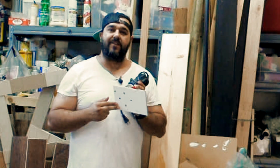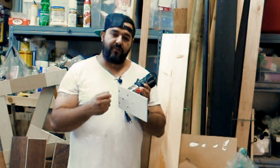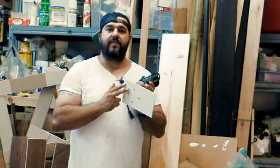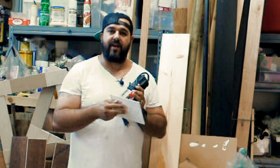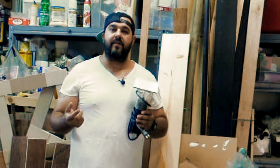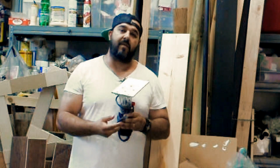four 1/8 inch holes for the screws to pass through. And then I countersunk those so that the screws sit below the surface of the hardboard so that there's nothing scratching your project when you're making your circle. I didn't go into the details and measurements of my jig because it's specific to my project.